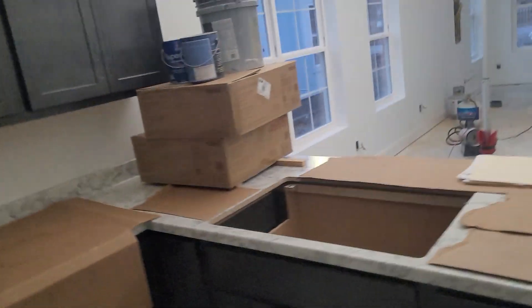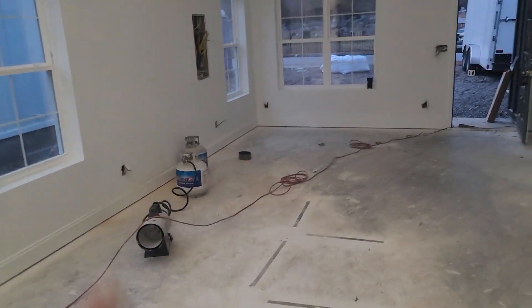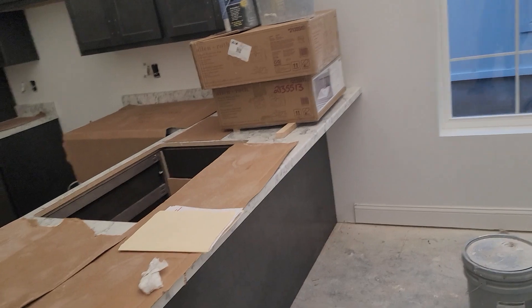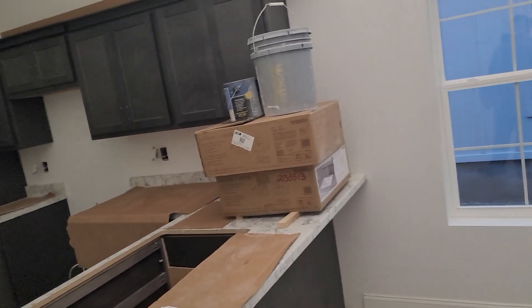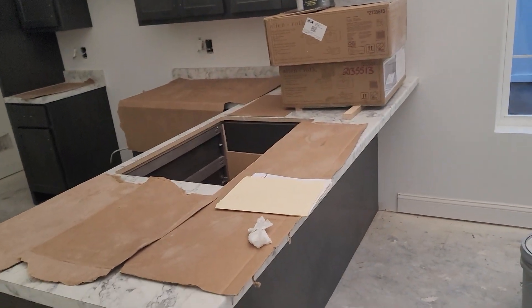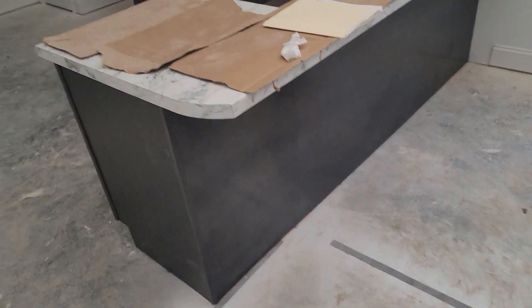You've got some weight here on the corner of the countertop. We've got a really wet, nasty day outside, so our countertop had a little bit of a bow in it. We went ahead and put our screws in, put our glue underneath it, and weighted it there in the corner to try to get some of that bow out. Once the air conditioning is turned on in the house, it'll settle out.